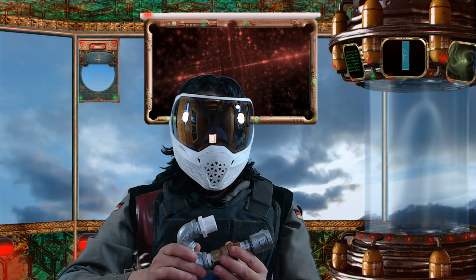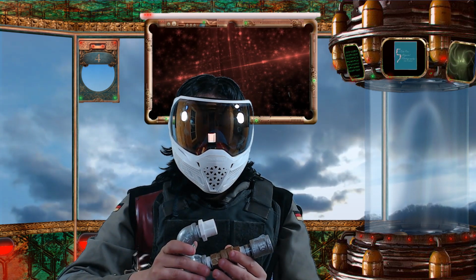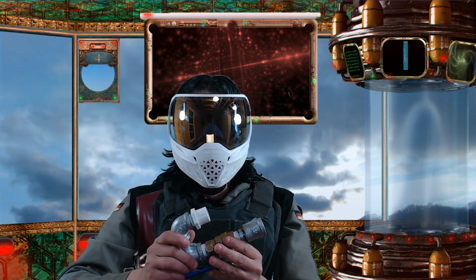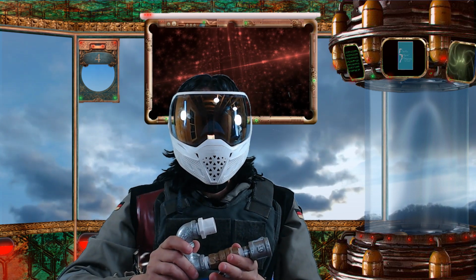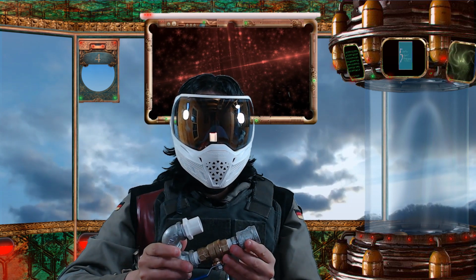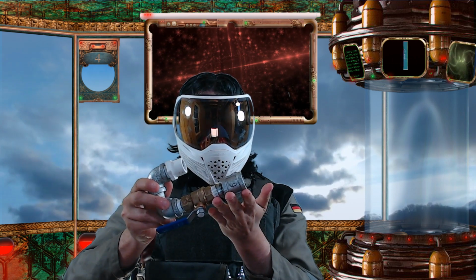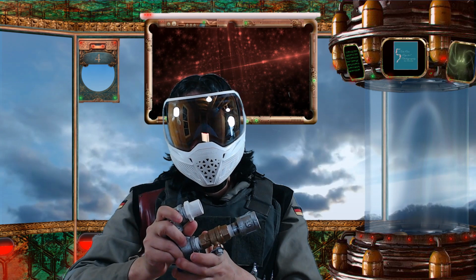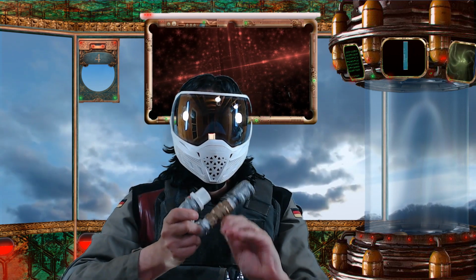Where was I? Okay, so, yeah. It's missing the CO2 adapter, which will hold the CO2 cartridge, and of course it's not connected to the barrel. When completely installed, though, inserting a CO2 cartridge into the adapter will puncture it, pressurizing a section of the assembly below the ball valve, right here, to around 850 psi. It can vary depending on temperature.